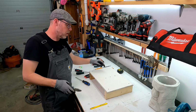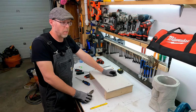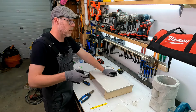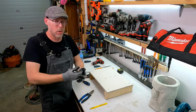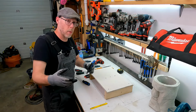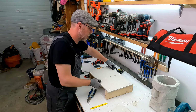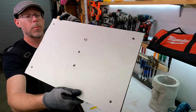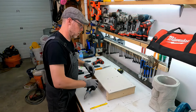So the drywall anchor stripped before it sunk in all the way. If I had better technique, it probably wouldn't have done that, but I was kind of awkwardly holding and pushing. What I should have been doing is applying more steady and consistent pressure, but I wasn't. Maybe you weren't either. Oh no, like that's 1/8 inch or more proud of the surface, and I'm not satisfied with that. Like, you could use it, but I wouldn't.